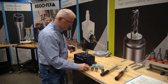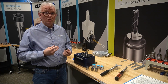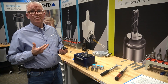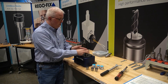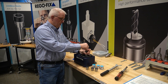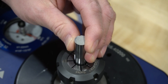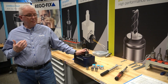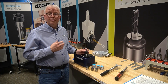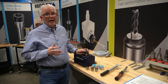What about the 14mm to 13mm collet? It's 0.3mm too large. Will it clamp down far enough? The technical answer is no. Attempting the assembly, the collet won't go down far enough — there's not enough movement on the 14 to 13 collet to clamp down to a size below 13mm. ER collets have a designated clamping range — depending on the ER series, either a half millimeter or one millimeter. Anything within that range is suitable to use.